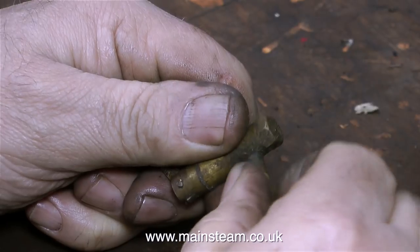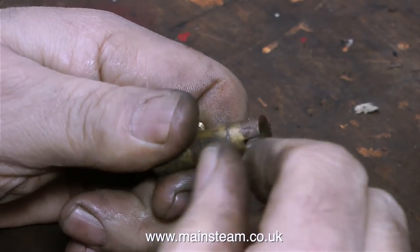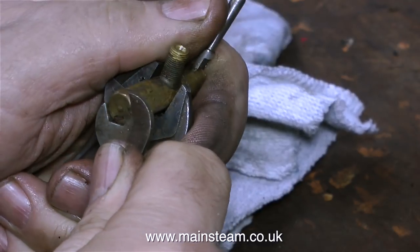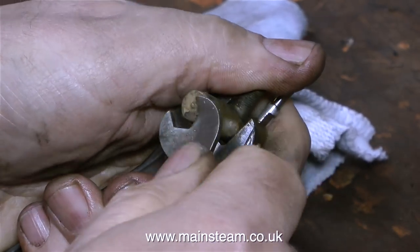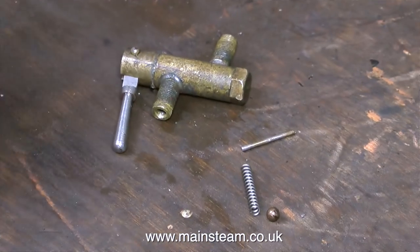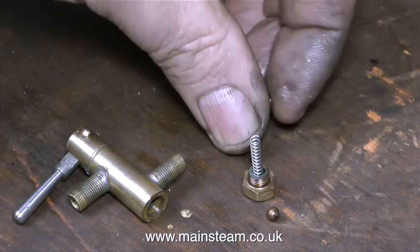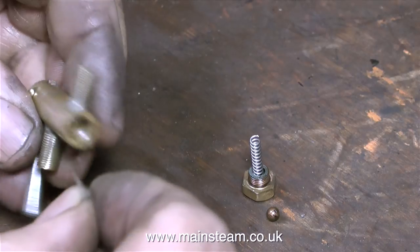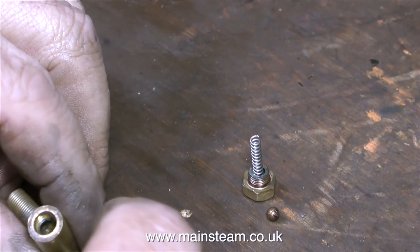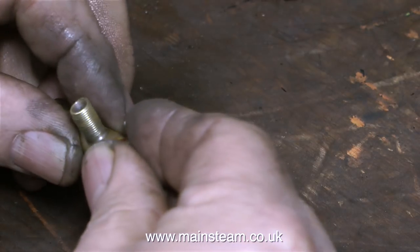The next steam fitting to look at is the whistle valve. Like most things on this engine, it's very well made, but I'm going to pull it apart and have a look at it internally. A whistle valve is quite a simple device. Inside this body is a stainless steel ball that is held onto the seat with a stainless steel spring. When you move the handle, it depresses a push rod that just pushes the ball off the seat and lets the steam through to the whistle. The nut on the end of this valve was very tight, but finally, with the help of my Bahco spanner, I managed to remove it, and here you see the components of the actual unit. The original spring was stainless steel, but I made a new one. The spring I'm showing currently is wrong in two ways: the end hasn't been ground square, and it's too small a diameter for the ball. The solution was simple — I used a spring of the correct diameter, ground the end square, put the whole thing back together using some Loctite 542 on the nut, and the whistle valve is pressure tight.